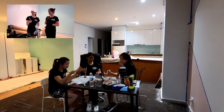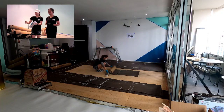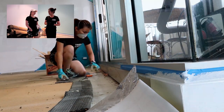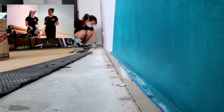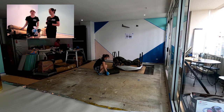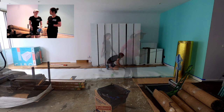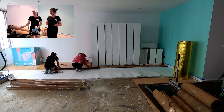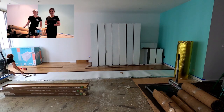Just be really careful and don't step on it or hurt yourself in the process. Pull it from the edge and cut it along so they're not massive rolls that you can't handle — it makes it easy to dispose of and move around the place. My recommendation is to keep small rolls so you keep the dust and dirt all together. Then you rip all that off. There's also some underlay, so you want to fold that and rip that off as well.